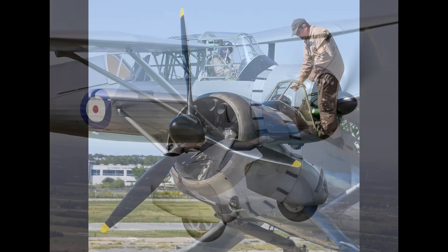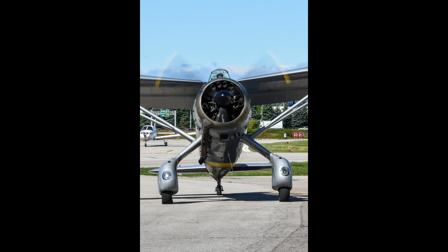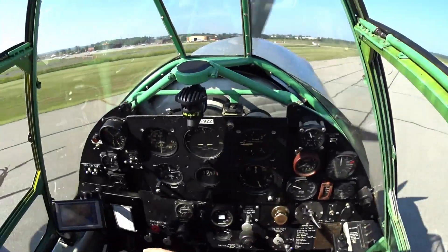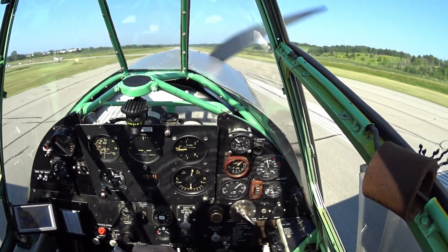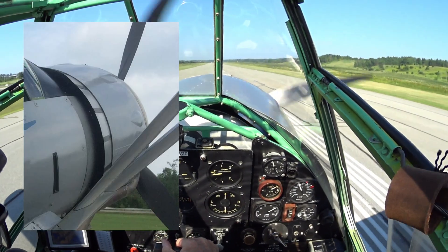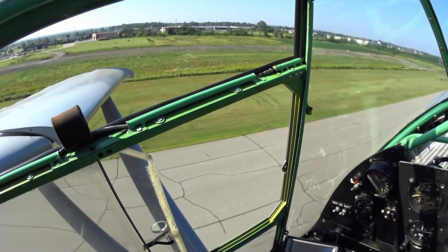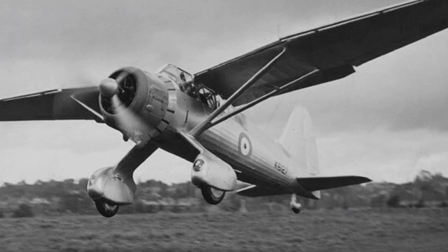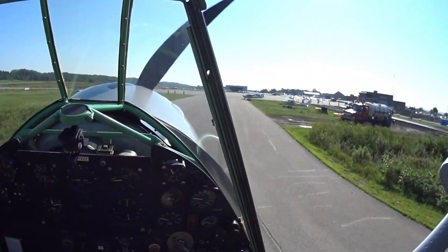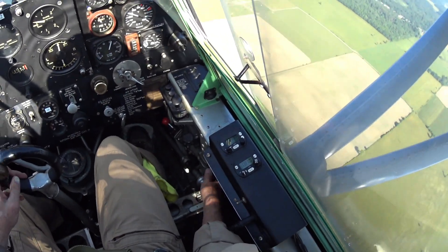Another very unusual aspect of the Bristol Mercury engine is that the exhaust collector ring is the leading edge of the cowl. From the pilot's point of view, it's not such a great idea. As soon as the engine gets started, it gets hot, and then it heats the air coming into the cowl that goes across the cylinders — particularly the cylinder heads. So as you taxi the aircraft, the cylinder head temperature gauge shows a continuous rise in temperature, and the gills — the cowl flaps — even fully open, can't quite deal with it. In some ways it's like the Spitfire on the ground: you have to keep your taxi time to an absolute minimum. In 1937, taking off and landing in a big open grass field, this wouldn't have mattered. But at modern airports with skinny paved taxiways, it's a significant thing. However, once you get airborne, the temperature drops — no problem — and you find yourself closing the gills to keep the temperature at a good working level.